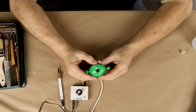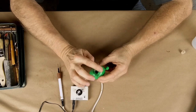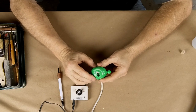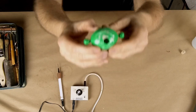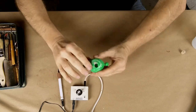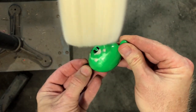This piece was kind of a mess. It had been floating around in the ocean for a while, but more than that, I think it had been chewed by a dog. It was really dinged up on one side, so I began by puttying up the dings with some Magic Sculpt, an epoxy-type putty. Then I sanded it down and polished it — just put it on a buffing wheel. Most plastics and resins polish out really well, and even this epoxy putty polishes out really well.